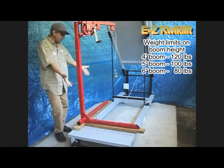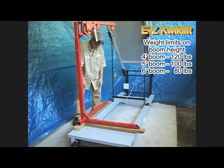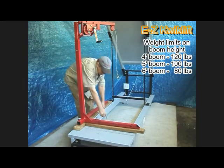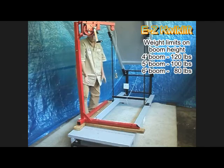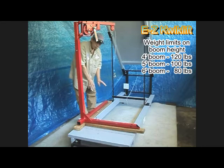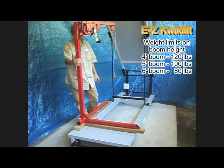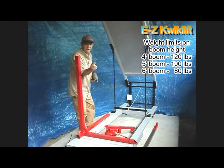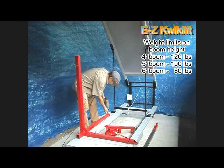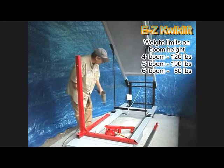For example, in this situation, if you're in need of using 2x4s, if I screw those 2x4s down with these 3-inch screws, now I can screw these legs down. That's exactly the way you'd want to do that if you had an irregular surface around your door. A lot of pull-down doors will have missing boards, and you'll have to shore things up to make one of these fit. Use 1¼, 1½-inch sheetrock coarse thread screws to anchor this frame to the frame of your pull-down hole.